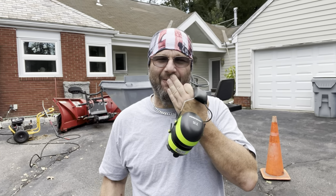All right, so they're right there behind me. I ended up not going ag tires on this. I went with a tractor, kind of like a turf tire, but it's a little more aggressive than a turf tire. I think they call it a tractor snow tire. You'll see, but they're really skinny. They're still the same thickness because I only have a 4-inch rim, so I can't go any wider. I wanted to go wider tires to spread out the weight load on lawns, but I wasn't able to. So I ended up going with these tires, and I got the same tires for the rear steering tires. I do believe they're called like a Euro. So I'll show you what they look like, and let me get some grease in these fittings, and then we'll throw these tires on real quick.